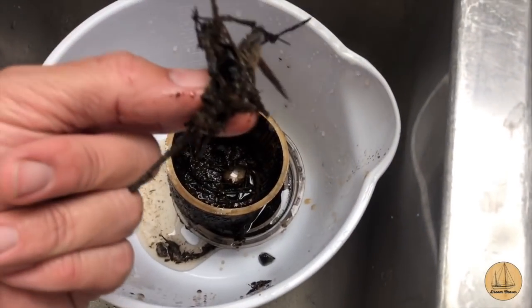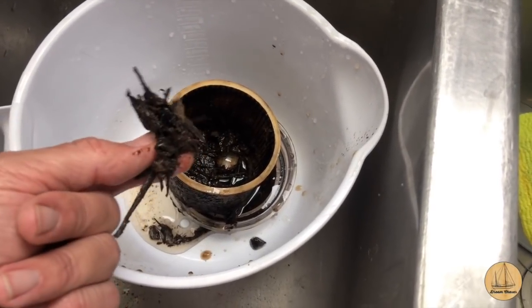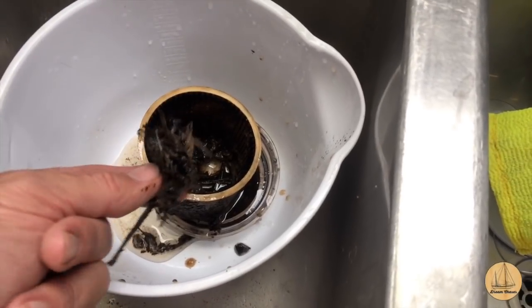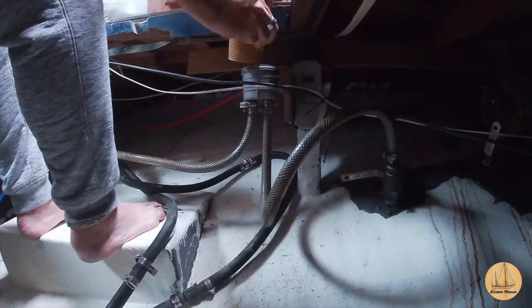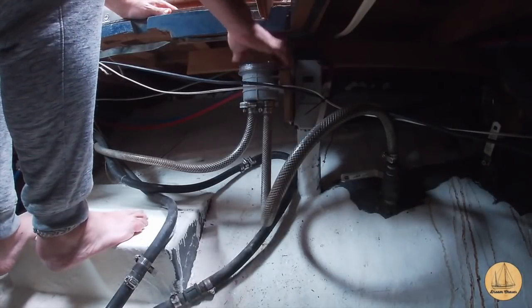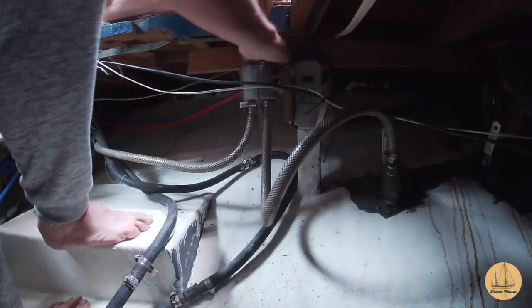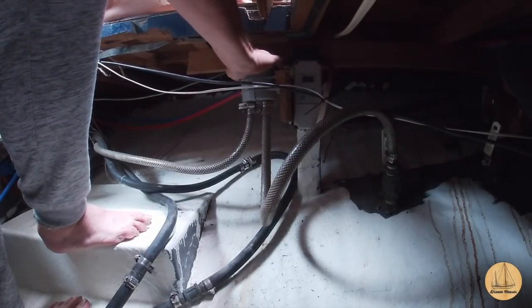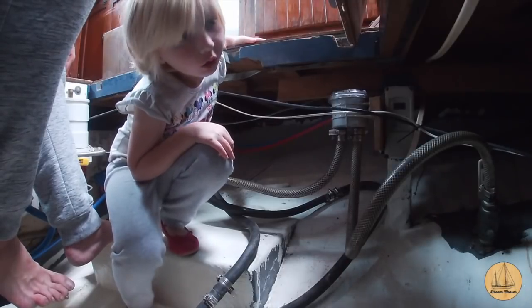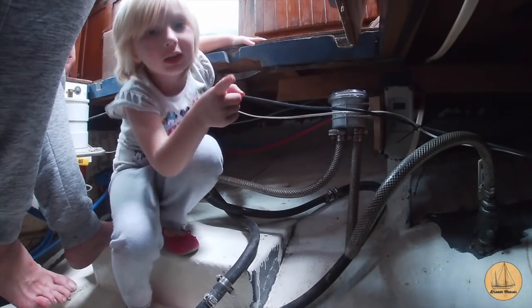This one is definitely a little nastier — I've got some downright grass and growth in this one. My guess is when I start the engine and kick it into reverse, I probably kick up some garbage off the riverbed into the air conditioning unit. The strainer catches all that crap. Now it's just a matter of reversing the process — putting the sea strainer back in. I lightly put this lid on, don't tighten it all the way, then open the seacock. This one actually primes better than the one in the back, so as soon as water starts flowing out around the threaded edge I tighten it down the rest of the way by hand.